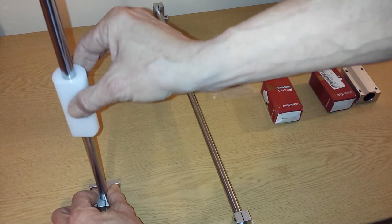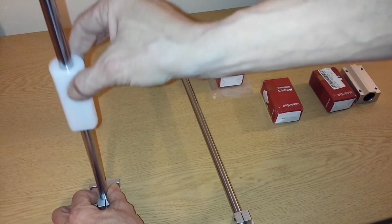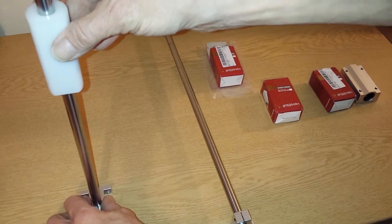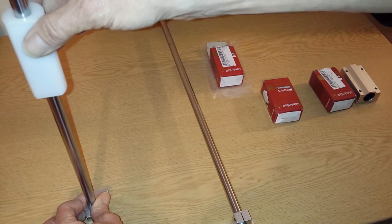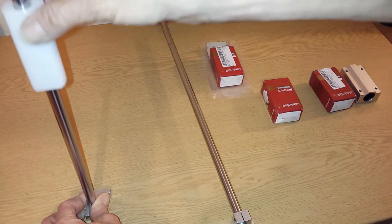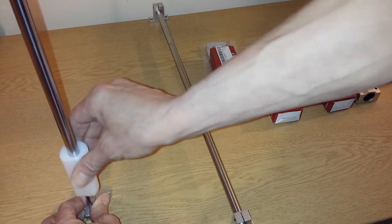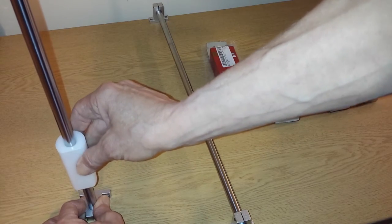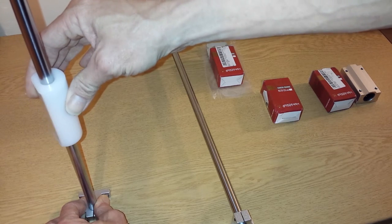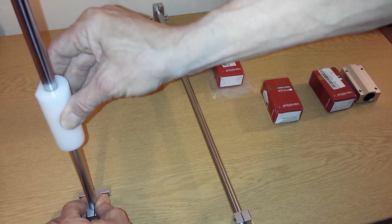But what you'll see is, in some points of this rod, it's very loose. Now, bearing in mind, this plastic has been reamed all the way through, and the hole is pretty true. For the distance that it is, the hole is extremely true. It's not perfect, because it's only been done with an H7 reamer, and only on a small lathe, so precision, not aircraft quality, should I say, but it's good enough to show exactly what I'm trying to demonstrate here. This rod, if I twist that now, doesn't move.